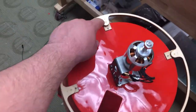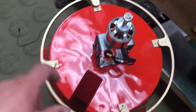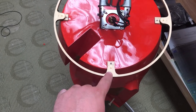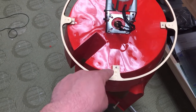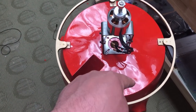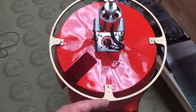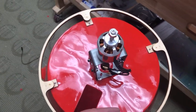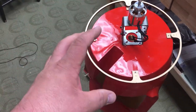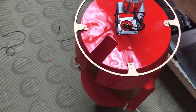It's funny because it'll be centered on each one of these tabs, and there'll be bigger gaps here and smaller gaps here. Now that I've got it mostly under control with the little markings, I've got to drill holes through here, put screws in each one of those, then drill those out one at a time progressively and put in bolts with blind nuts. So it's kind of a process — bear with me. The manual should have had you mark these first before you center this. I don't know why they did that, but lesson learned moving forward.